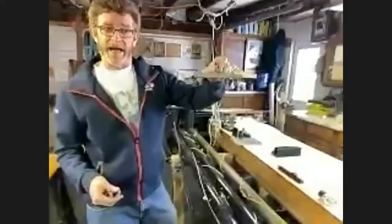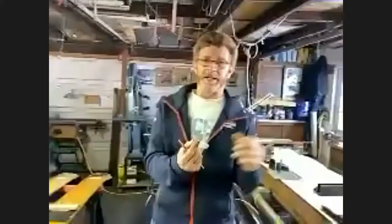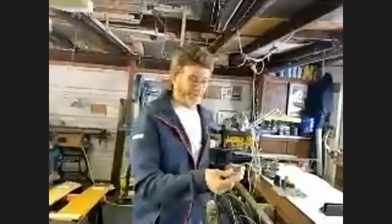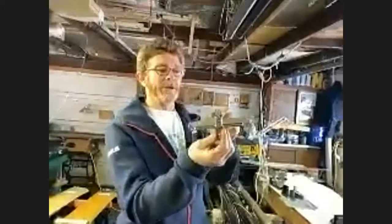The Strubel hound makes sure the mast rotates through the tacks and jibes — when you just have a triangle where the shrouds meet, it's hard to get the mast to rotate well. With the new masts, Eric Smith machined a titanium hound that you can see is much cleaner, smaller, and more aerodynamic.